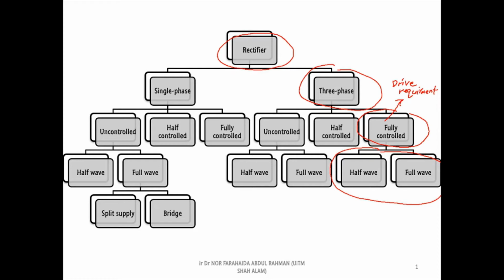Like other control converters, the three-phase control rectifiers need a control signal for their operation. Similar to the single-phase control rectifiers, the control signal for the three-phase control rectifiers is supplied from a single source at a specific firing angle. The effects of the firing angle can be seen in the conduction ranges of the power switches and the waveshape of voltage and current waveforms.